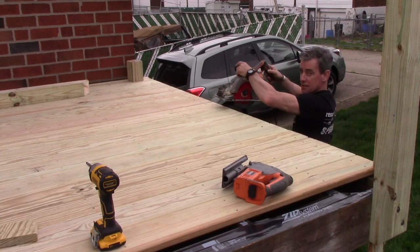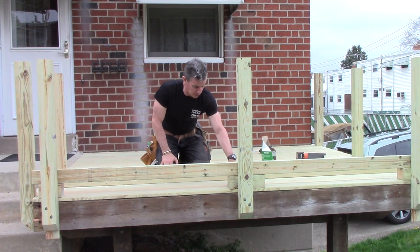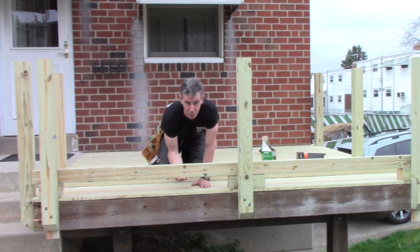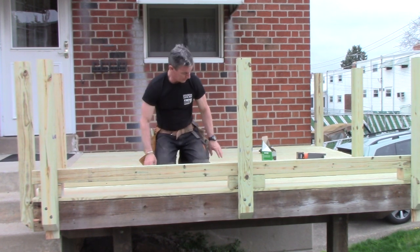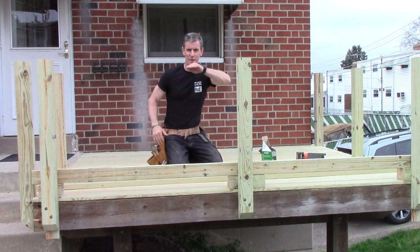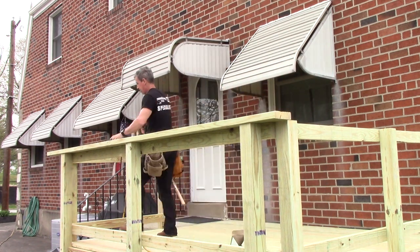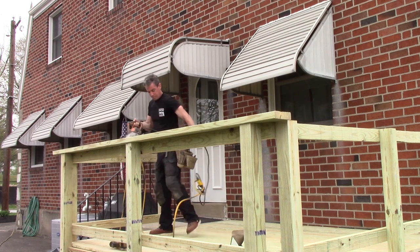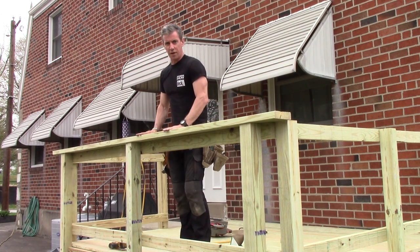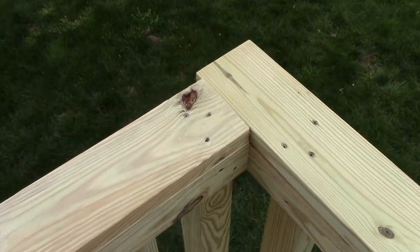More round blade, square notch action. I crop up 4x4 blocks after I do my layout — that gives me the appropriate gap to blow leaves through, and so it conforms with not fitting a 4-inch sphere through this space. I lay out both my rails at the same time, get them installed, put pickets in, and the 2x6 top cap. I'm cutting with my good side down. This is the front top cap, and I'm going to use it to lay out the other sides coming back.